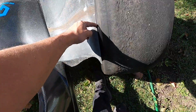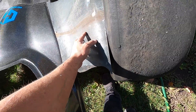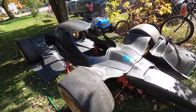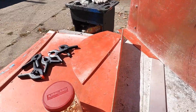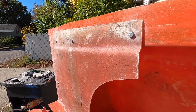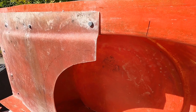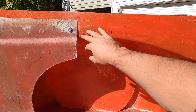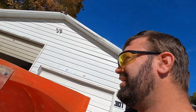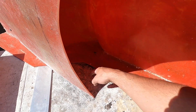These are old scrap parts but I'm using them for measurements. As of now the fenders only go to about here, so I have to extend that inner fender piece so it goes the full length to fully support the fender. I basically have to make a dummy part using the inside of this mold so I can fasten it and then overlay and extend the mold back. Sebastian and I designed the car five years ago via Facebook Messenger and he's in Switzerland, so some things were probably lost in translation.